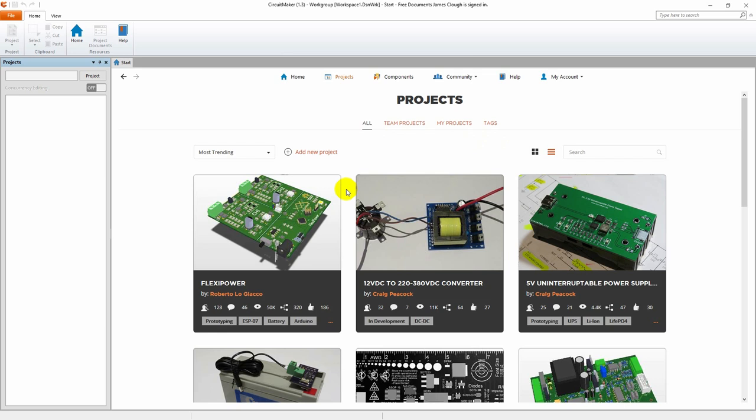That's the primary limitation if you were thinking about using this for a commercial project. In my case, what I'm building here is open source hardware, so that's perfect. I did also consider using Eagle — especially since it's been acquired by Autodesk and it's in the same software family with Fusion 360 — but the free version of Eagle has the limitation that it can't be used for commercial purposes, so you can't design a PC board and then sell them and still be in compliance with the license.